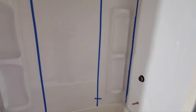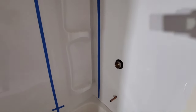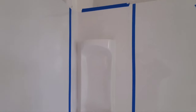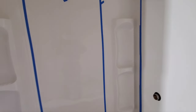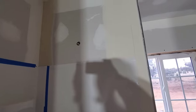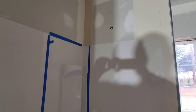And voila — I got it in. As you can see, it's a bathroom, kind of hard to get in there. I have taped up everything. The corner ones — they're not made perfect, but anyhow. I didn't peel the coating off the corners yet — I just got them all taped up. I'm going to let it set for a day or two. I got plenty of other things to do. That's the long and the short of putting it in. The shower head is a good eight inches — I actually like to have it when putting in a one-piece tub wide enough so my taping knife will go underneath the pipe. So that's about it — installing a tub surround.